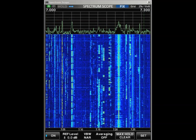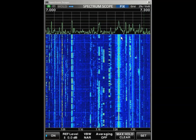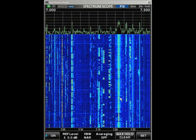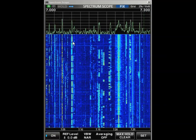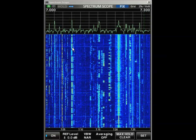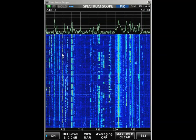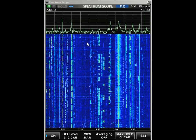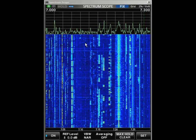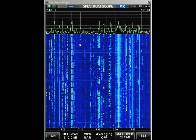You can tell a lot on this scope about what's going on. You can tell AM signals by these bright lines down the middle. You can tell these are intermittent transmissions of people trying to make contacts on very low power. You have CW, some areas that are fairly open. At least I can't hear a whole lot here. You have an occasional static crash — that's what these horizontal lines are.